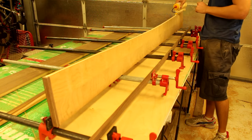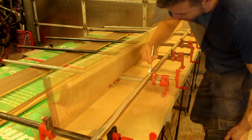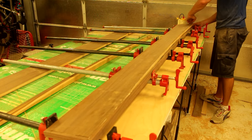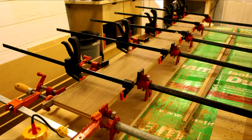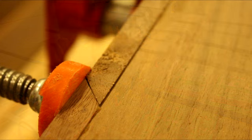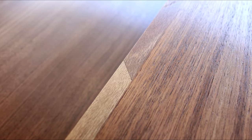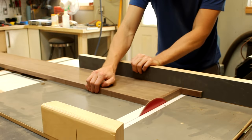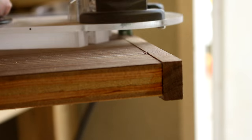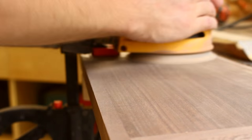I glued the tops and the bottom solid wood edging with clamps. When joining two pieces of edging, you can use a miter joint and place a clamp right on the joint. This is what that joint will look like in your final product. I use a cross-cut sled and support the workpiece on the other end to trim off the edges. I use a flush trim jig to trim down any proud edges, then give the face a quick sand with 220 grit sandpaper.